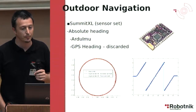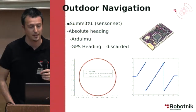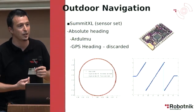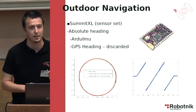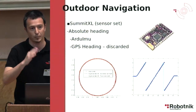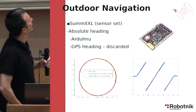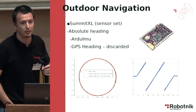An additional sensor we used is the ArduIMU, used to estimate the orientation and heading of the robot. This sensor has to be calibrated: you put it on the robot, perform some 360-degree rotation, then plot the values and get an ellipse. To correct the values in 2D, you fit an ellipse and adjust the X and Y parameters; in 3D you fit an ellipsoid. On the right image there is a comparison of the internal gyro during a pure rotation motion with the heading obtained from the magnetometer.